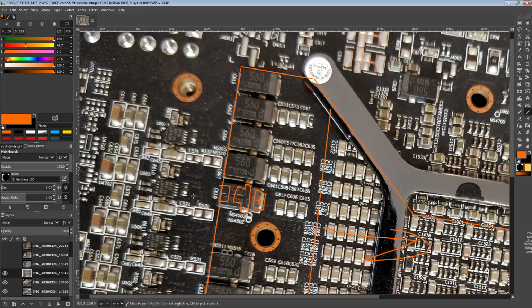The other downside is you can't really get them in endurance ratings above 2,000 hours at 105 degrees. We see a lot of motherboards and GPUs advertising 10,000 hour rated capacitors. Well, they don't make these in 10,000 hour ratings because, quite frankly, the 10,000 hour rating is kind of silly, unless you're doing server hardware. It depends on your application, but for gamers, it's very silly, because if you have an 8 core CPU, you're probably never going to use more than 4 to the full. You're never really going to max out its power consumption, so the VRM's never going to get that hot. So the high lifetime rating doesn't really matter that much.